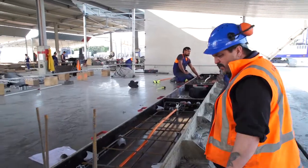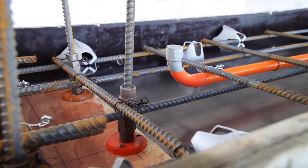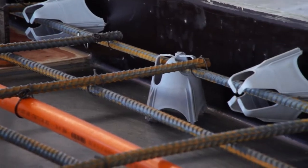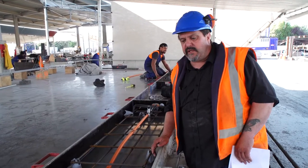What we've got here is a setup of a small panel, 150mm thick. What we've got to try and do is keep the steel in the middle. The 65mm keeps it central and the 50mm keeps it at 50mm cover each side, which is the engineer's requirements.